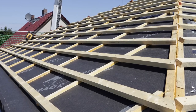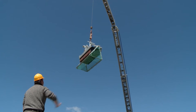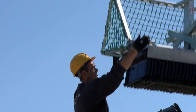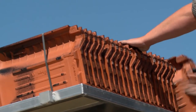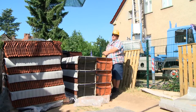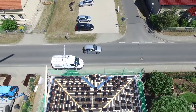The roof of the house is prepared so far and the roof tiles can come. A so-called flat roof tile made of fired clay with a matte black glazed surface is used. For each of the four roof areas — approximately 32 square meters each — approximately 300 bricks are required, a total of around 1200 pieces. With a weight of approximately 4 kg per tile, that comes to almost 5 tons of brick mass on the roof.